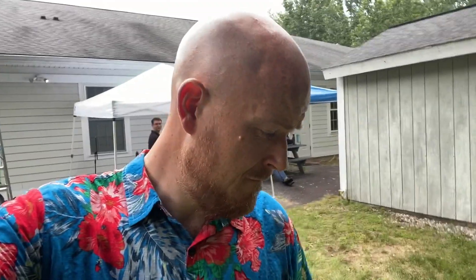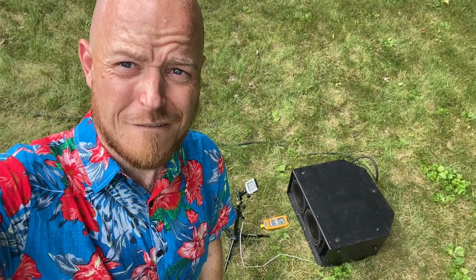This takes a really long time. We've been here for a long time waiting for this thing to get hot. It's not so hard to make a woofer coil hot, but to make it hot without destroying it and find out what the long-term limit is going to be takes a really long time — you're on the curve waiting. Three hours later. This thing has reached a steady state around 60 degrees C, and the sun has gone behind the clouds so there's another heat source gone. We're going to bump it up to 150 watts and see what happens, then call it quits in about 15 minutes.